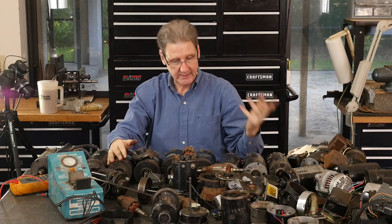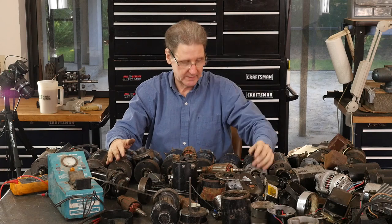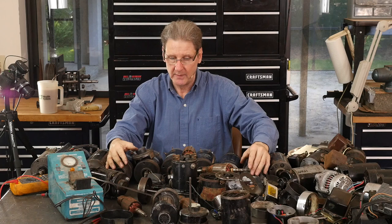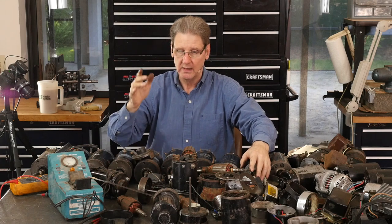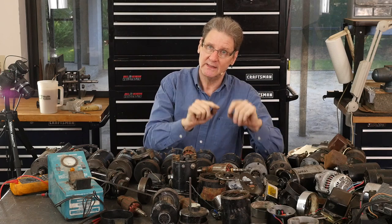So we'll be back next time, get more into these generators, take them apart, show you how to rebuild them, and show any problems as they occur to me as I go through it. But that's the general overview. Check out that Harley K-Model website for details and the parts books that'll tell you exactly. Because I guarantee you, if you have an early 65 Sportster that you want to make a 100-point show bike, it better have the 6-month-only 65 part generator in it, not the 65A, because they probably did some internal improvements.